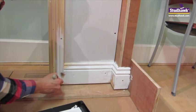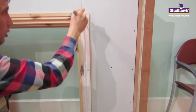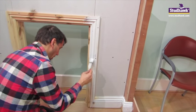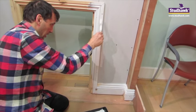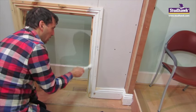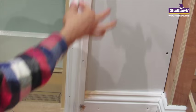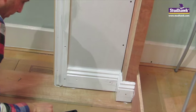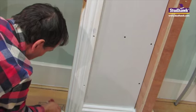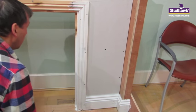Paint into your architraves — the hardest bit to get the brush in first. Make sure that's done all the way up, into your corners. Make sure the paint's gone into every little cranny. The pressure putting the paint on is quite forceful, to work it right into every little crack. And the laying-off technique is very gentle — in fact it's just the weight of the brush doing the laying off. We're going to do a fine sand between this coat, then start to apply the filler first — to every screw hole and every little punched nail hole.